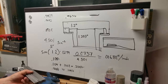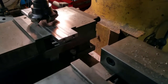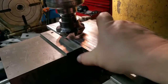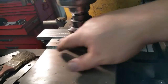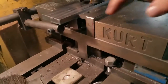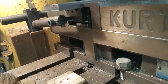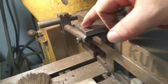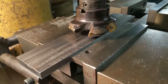I'm not going to show squaring it up - that's boring. I'll show it clamped up on the sine bar, take a couple cuts, and then show you the finished parts. So I'm doing a little free handing here so you can see what I'm working on. I have the gibs in there, I've squared up the edges so the face is square to the sides, the sides are parallel. I have the sine bar underneath, and a quarter-inch thick piece of ground stock clamping the gibs to the fixed jaw because the gibs are slightly narrower than the sine bar. I've got a stop wedged up against the sine bar, tightened the vise down, and beat the gibs down onto the sine bar.